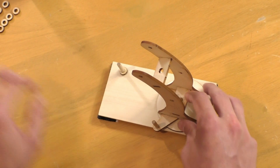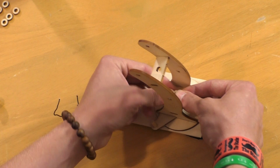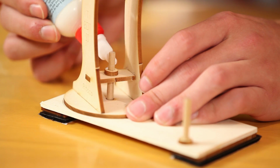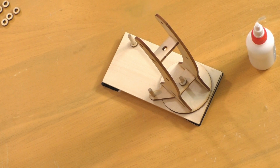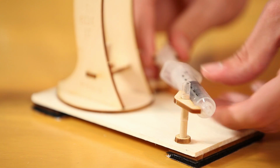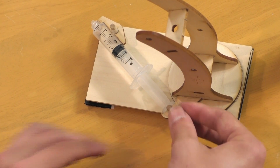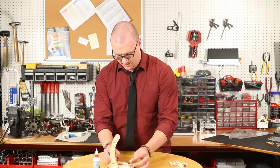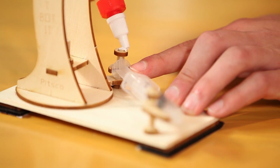And after you have the swivel base on there, take one of the R pieces and put it over the center dowel rod. Once you have the R piece secured on the dowel rod, put some white glue on top of the R piece. Take the swivel base syringe and the U end goes on the swivel base over the dowel rod, and the Q end goes on the platform dowel rod. After you have the syringe over the dowel rods, take 2 R pieces and secure it over the dowel rods. After you have the R pieces over the dowel rods, secure them with white glue.